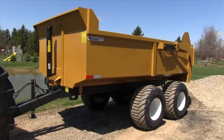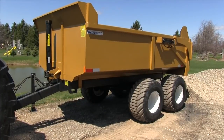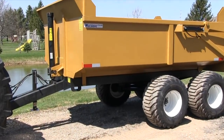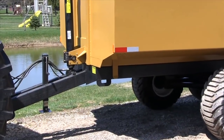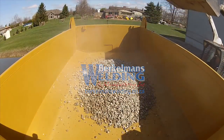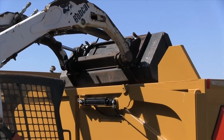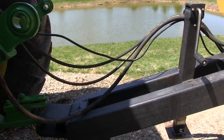Berkeman's Welding would like to introduce their 12-ton tandem axle farm dump trailer. Key features include 8-inch by 4-inch by .188 tube mainframe and tongue, a 7,000-pound drop-leg trailer jack, and a swivel hitch for rollover safety with an inch and a quarter pinhole.